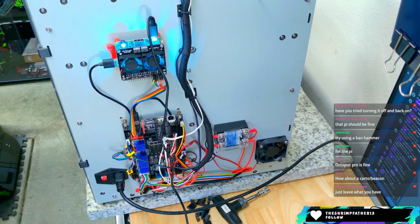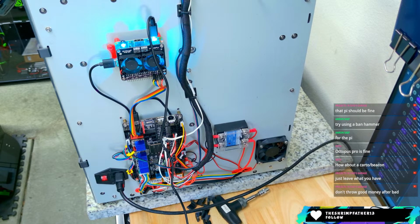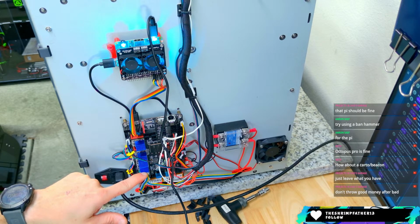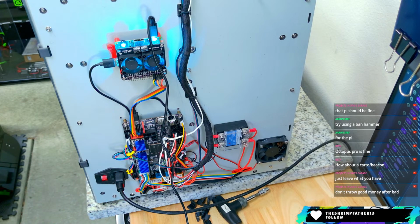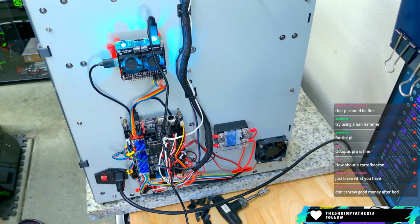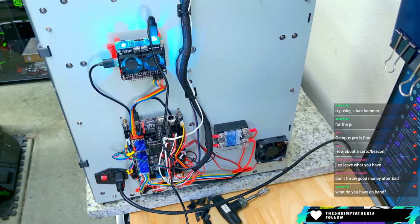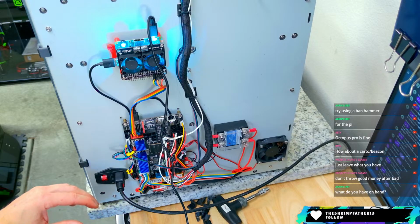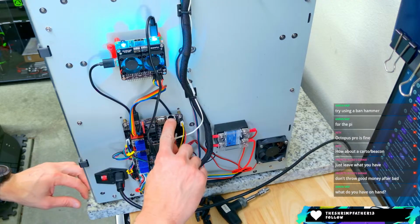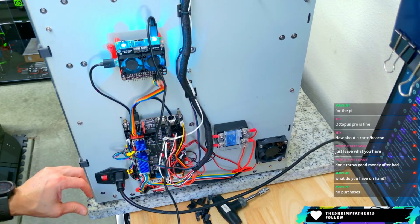I know that there's a Manta 5. There's also a Manta 4, but at minimum we would have 5 motors. So we could probably get away with a Manta 5 and then just use a tool head board. That would clean up some of the wiring as well. So this wire stack here would go down to just a CAN cable. And I know that through this RJ45 port, you can use a CAN adapter to make that work.